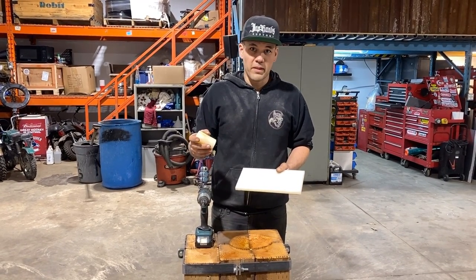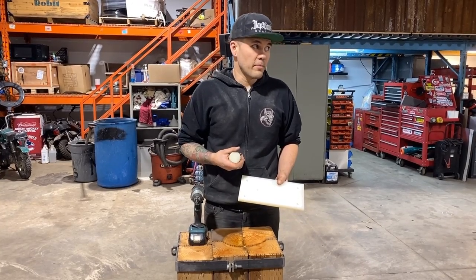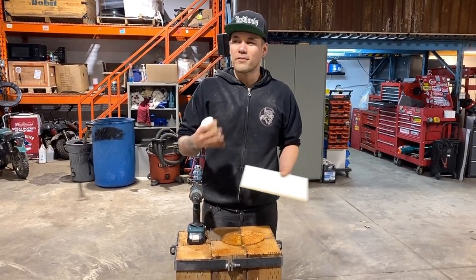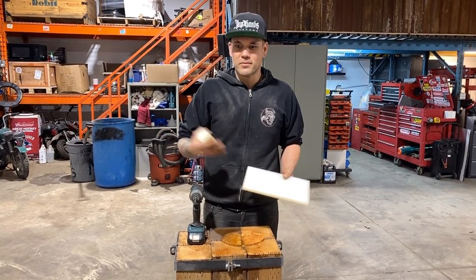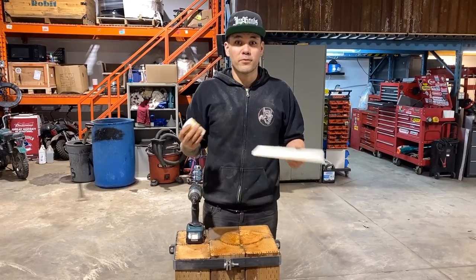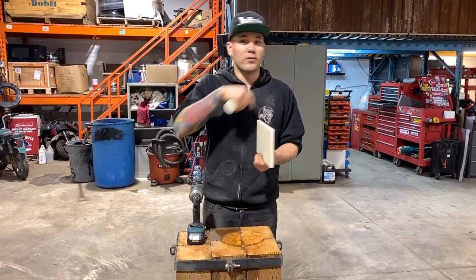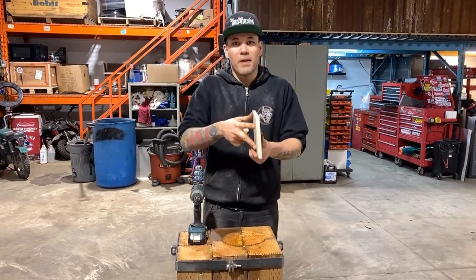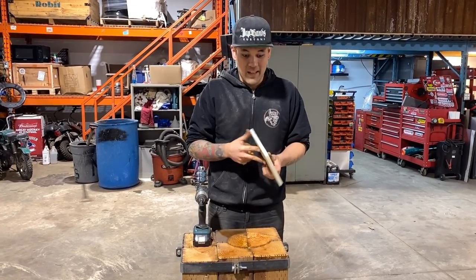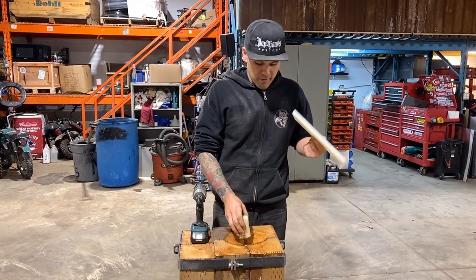And a lot of those other plastics, like Delrin, or the one that I can't think of the name of yet, they are meant to slide. Teflon's one of them, Delrin, and there's one other one. It's abbreviated. Help me out. But those ones are meant for slippery scenarios, like something bolted on the side of the bulkhead of a steel garbage compactor that slides back and forth all day. They're wear resistant and they're meant to slide. This stuff is grippy, and that's why you pay up for the nylon.